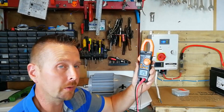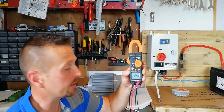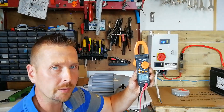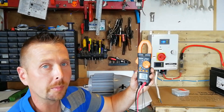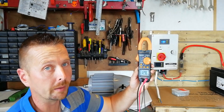The highest open circuit voltage reading we got was 129.6 volts, which is excellent. That indicates that the repairs have been successful and that we've also exceeded the 1000 RPM that Istabreeze states as their operating speed. The reading according to Istabreeze at 1000 RPM should be 80 to 90 volts, so it's good to know that it can well surpass that if required.